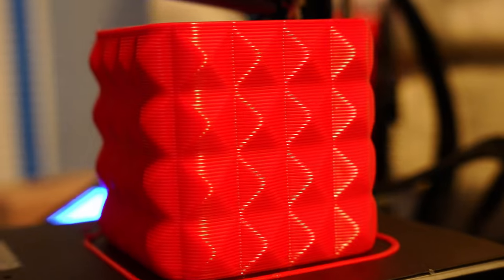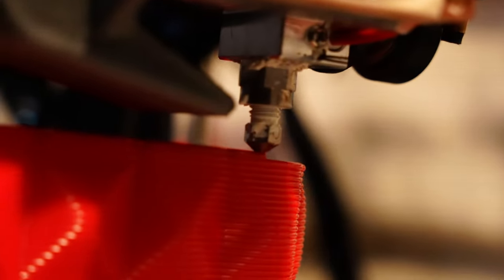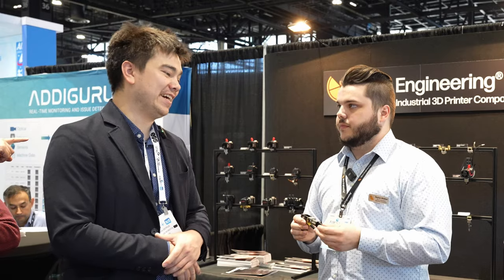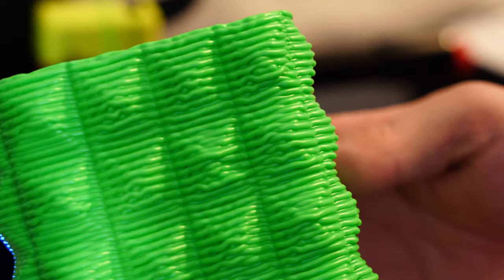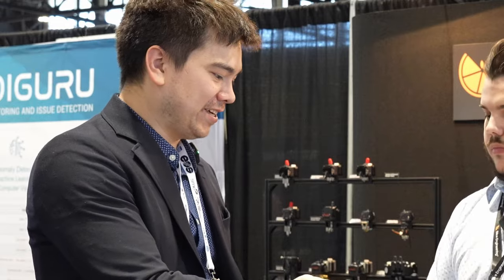I'm pretty familiar with high-speed printing on my channel. The fastest I've been able to print with stuff that looks decent is about 45 cubic millimeters per second — you're more than doubling that, almost three times. So pretty impressive. And like you say, when you start pushing those extreme rates, you end up with some little issues like it'll start shooting to the side or not having good surface finish.